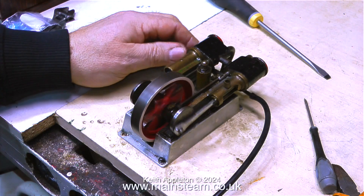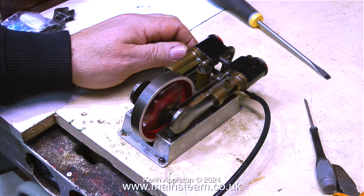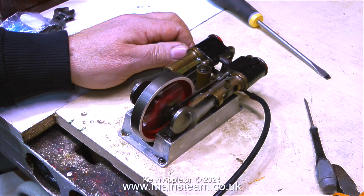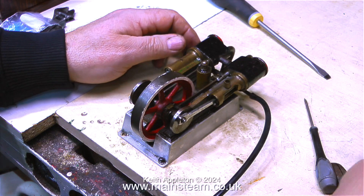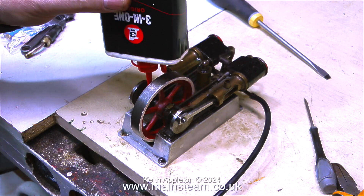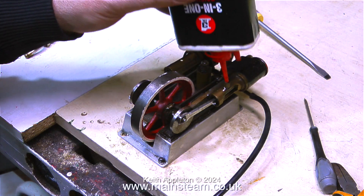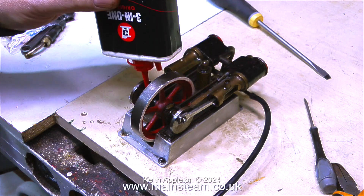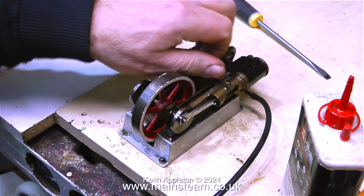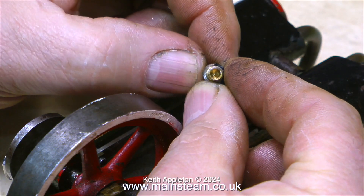With the correct settings the engine runs very well indeed. I'm quite surprised at this myself, and what is more surprising is there is not a trace of a leak on the piston valve assemblies. With an old engine like this it's a good idea to initially flood it with oil, run it for a short time, and then flood it with oil again, which will wash out any dirt particles from the mechanics. This is a piston valve engine, and piston valves wear out whereas slide valves wear in, so to speak — and the piston valves on this engine are not worn at all. Quite amazing.